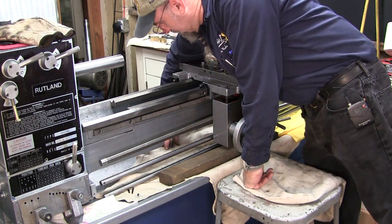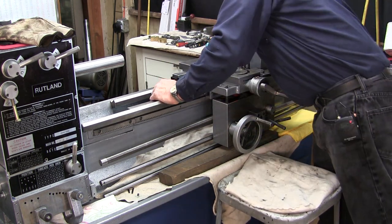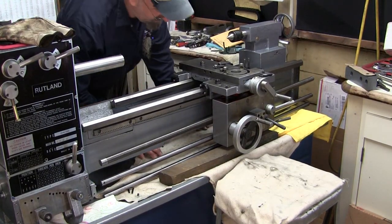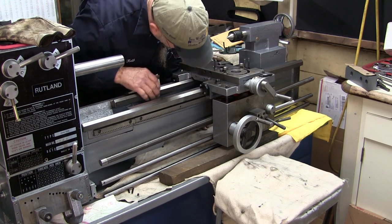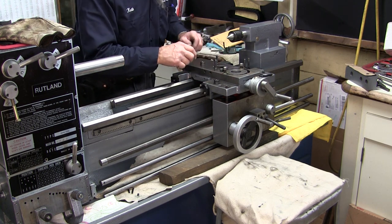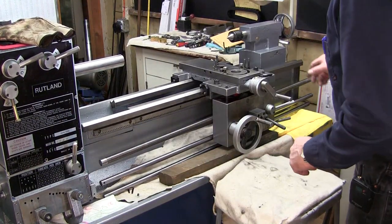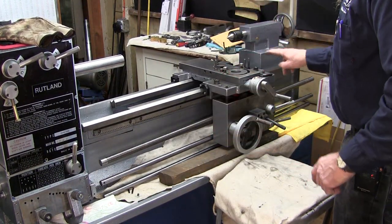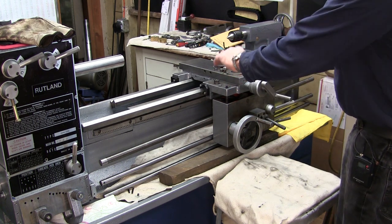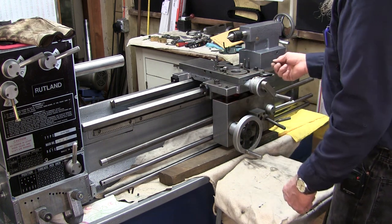Okay. We had our nuts here. Everything kind of took a little topple there when we broke loose the surface tension on the carriage. There's a new fit, and we threw some oil in there, and all right, there's our other bolt there. And there's our nut, one nut, there's our other nut. Okay, I'm gonna go get a couple of the mill hold downs to make up spacing because of our shoulder here, and we're just gonna slowly lift this up so that the carriage actually has got it, and then after the carriage has got it, we're able to move forward and aft slowly.